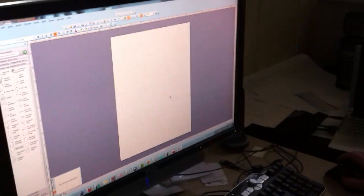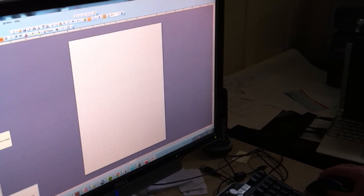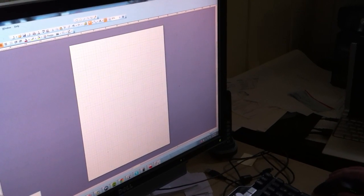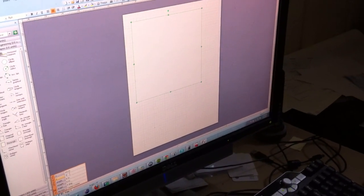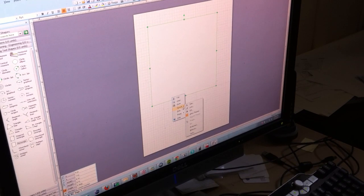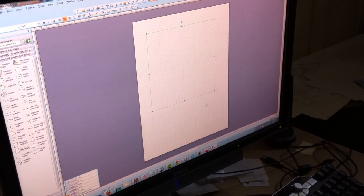Okay, so let's look and see what kind of design you're going to have for the plates. So we just use an octagon, 6 inches in diameter, and we'll just create 3 of those plates for the sandwich, and then the platform where the APM will rest on. Okay. So we'll just design that real quick because this is a scratch build. So we make that 6 by 6 inches. Position that nicely. I just need to make sure we have no fill on this. Okay, so there's our rectangle.